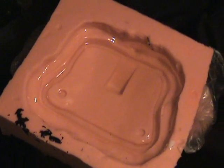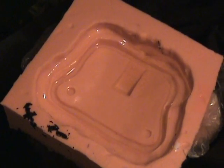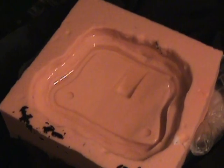I'm going to hold it stable. The cast is a little warm, so it's probably going to cure rather fast too. You see my inner wall, the small wall inside, that's what I'm focusing on. One thing that I was taught by a really good man is that you want to focus on getting your edges, and your inside will be done. That big old wall, the deep wall, that's just my overflow wall, so I don't get any on myself.